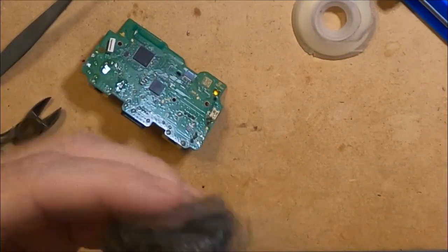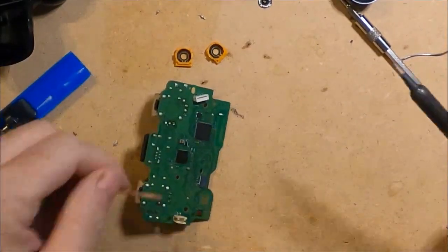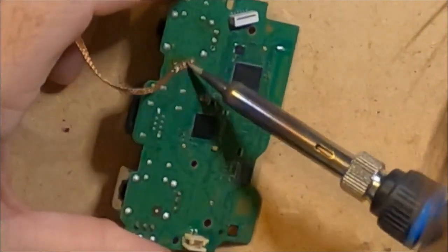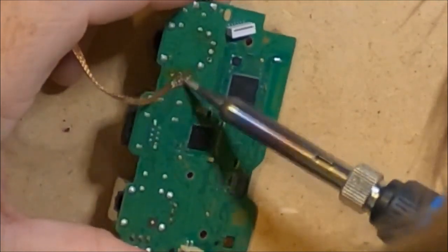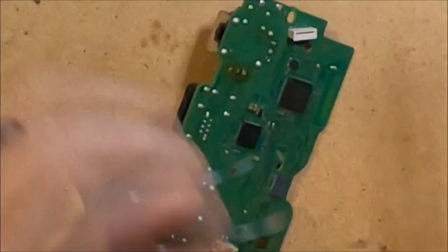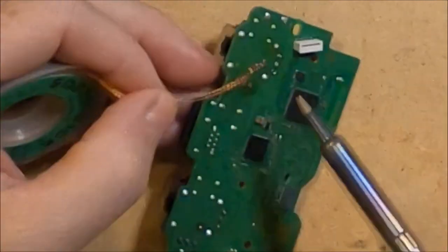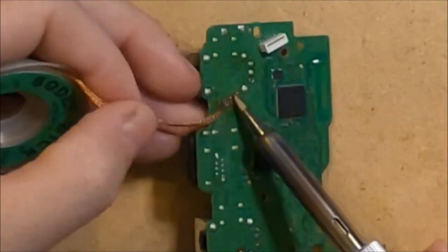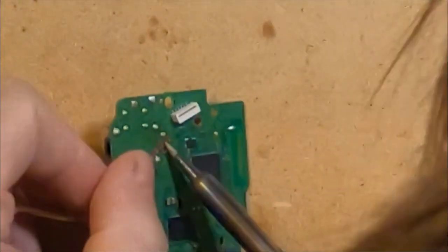I clean the soldering iron with a little steel wool. With all of the pins removed I will use some braided solder wick and clean up the surface. I have tons of room to work with here and can move the wick back and forth. I don't apply any force as I do not want to damage the board. This particular pin is the ground pin and it is giving me a little trouble, so I'll add a little bit more solder, and that seems to do the trick. Continue with the solder wick until all of the vias are clean.